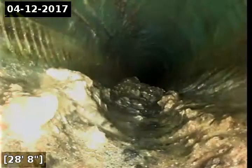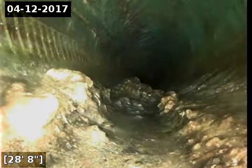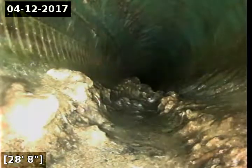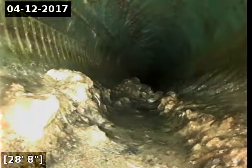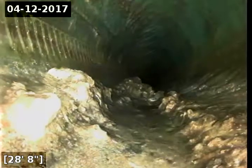So it causes a little bit of pooling of water here. Now here, a little bit of debris in the line and the pipe was relined. We can see why that ABS section was cut out and redone at those two T junctions, because they cannot reline T junctions where the two two-inch pipes connected into the four-inch. So this is where the relining, coming back in reverse, would have stopped — but this is the beginning of the line.